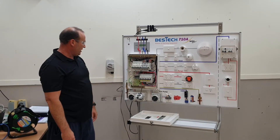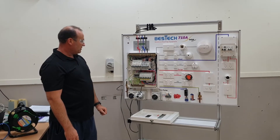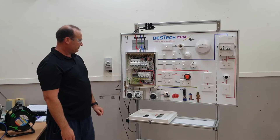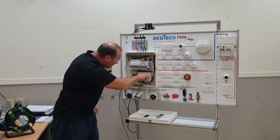You can see obviously there's our MEN link. The MEN link is on the furthest part of the bars, so it doesn't have to be labelled. And we can see here that all of our safety switches across the top they've all got the same sequence — our three phase all in the same sequence.